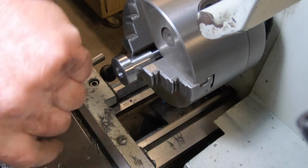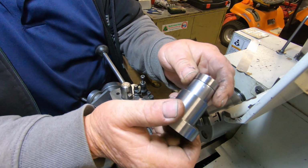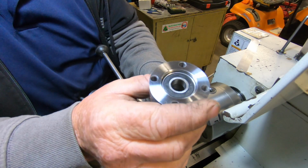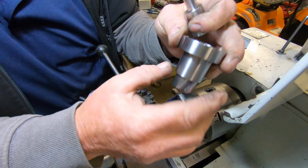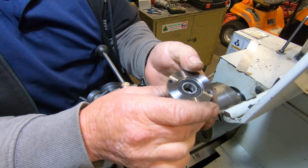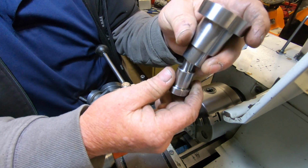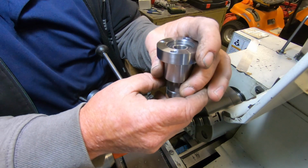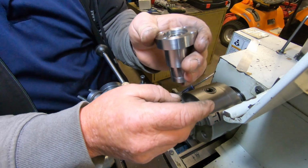Nice. So I've got this bottom bearing in. I'm going to have to go and push this bearing in now. I've got the thrust bearing in there as well. Got to go and push this bearing in, which won't take a lot, I can tell you. So I can work out what length I have to put this circlip, the retainer clip, in the end here. So I'm just going to duck over to the arbor press and do that. I'll be back in 2 seconds.